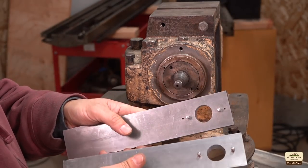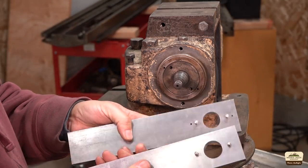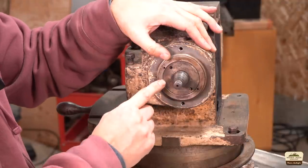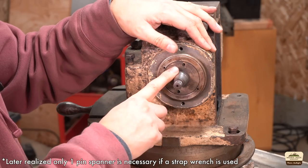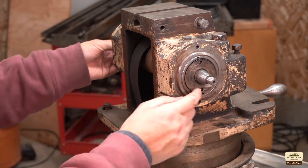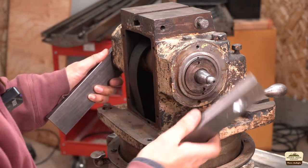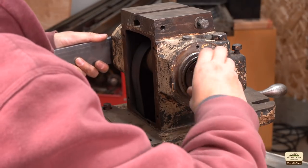I made two pin spanners — they're not going to win any beauty contest, but that's all right. It's identical on that side except one has two smaller pins on the outer diameter, just pressed in. The outer piece is stationary but the inner piece spins with the spindle — that's why I needed to make two of them so I can lock the other end. I turned the head around so you can see this side better. Don't ever say I didn't do something nice for you.